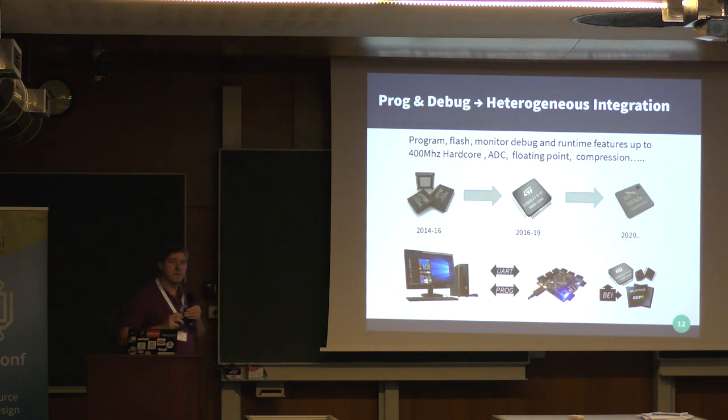We've also got an M0 on a lower-cost board. Later on we're looking at using Chinese variants — they do a 103 equivalent ARM-based core, but now also a RISC-V based core, and these are pin-for-pin compatible. An important feature for us is the external memory bus architecture. On the ECP versions of the core boards coming next, there will be an external memory bus connecting into the FPGA itself, giving connection into the bus running on the FPGA.